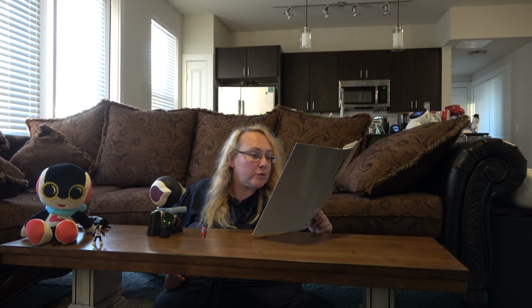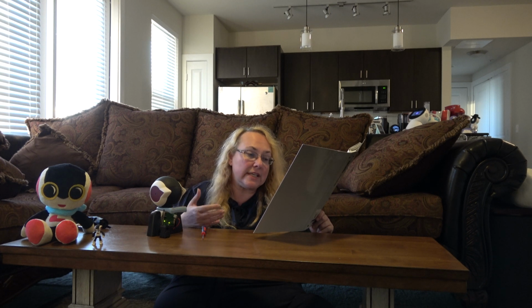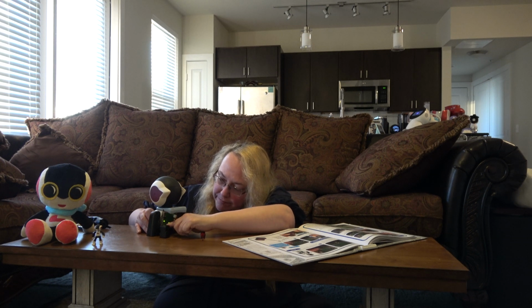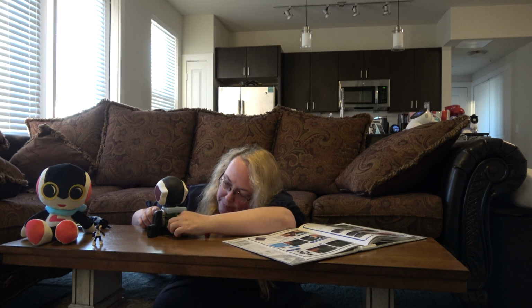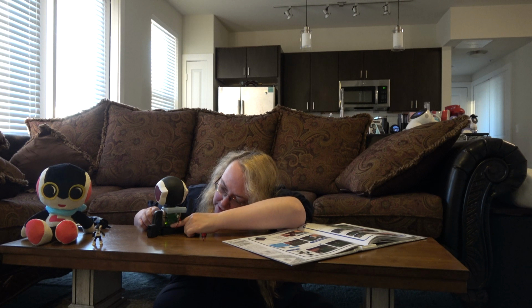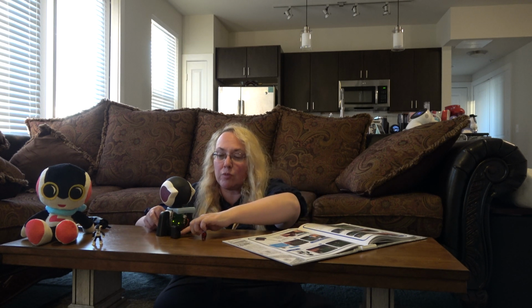Leave the servo connected, switch the power off, then back on. The 1 LED should light up, and then check the ID number by pushing test set, and then the 10 and the 6 should light up. It's crucial that all of Robi's servos have the correct ID number, so check thoroughly you've set the desired number. So we're going to shut it off. So it's off now. And then we're going to turn it back on. It's going to show 1. But if I push this, it should change to 10 and 6. And it did. And it also rotates.